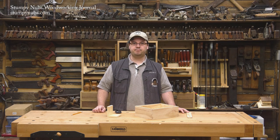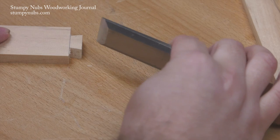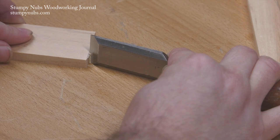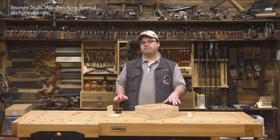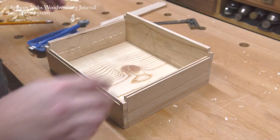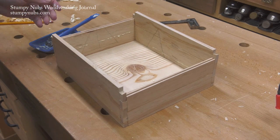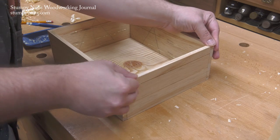So be patient and take your time. I found it easier to maintain the proper compound angle on the dovetails if I laid my chisel on the bench, tilting it to the right angle and then pushing my workpiece into the chisel. I could then tell by the thickness of the shaving I was removing if I was changing the angle or not. After you dry fit, you can rebuild your box for the last time with glue, layer by layer, all the way up. If this is your first time, you're likely to have some gaps here and there, but if you use pine like I did, you can apply lots of clamps and close those gaps up. And if any remain when everything is dry, you can add a mixture of sawdust and glue to fill them in.